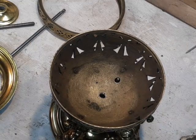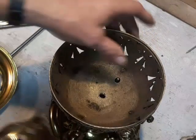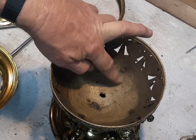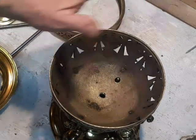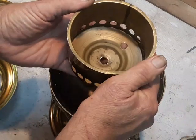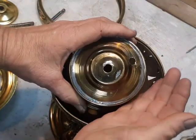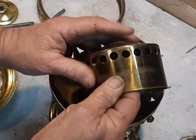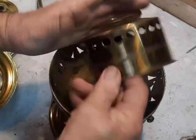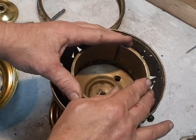When you're running wires through something that was never intended to be an electric light, you have to be very careful at all the points where the wire is going to contact something hard. For this hole, I rounded it off as much as possible to eliminate all the sharp edges. Then on top of it, I've got this piece of even thinner metal, which I've also deburred — got it nice and smooth. If it can't cut my finger, I guess it can't cut a wire either. When I put this together for the final time, I'm going to run a bead of silicone underneath here so that when it seats down in this bowl, that'll be one extra little piece to keep it in place and resist turning.